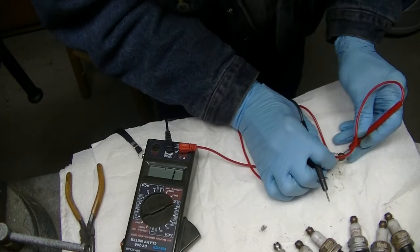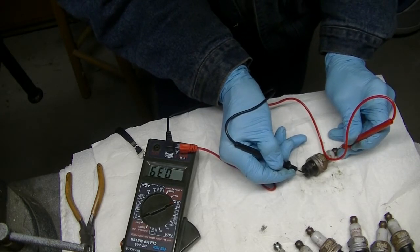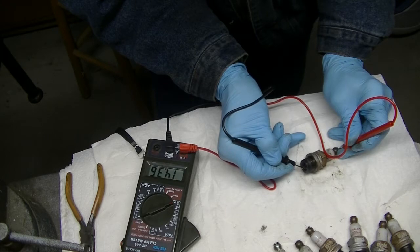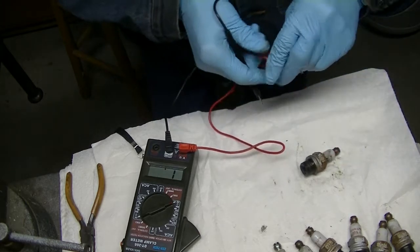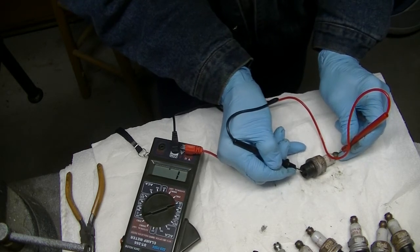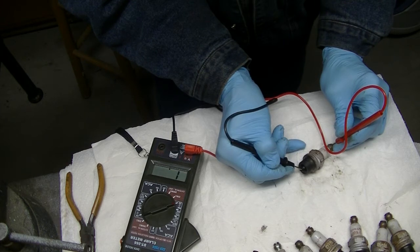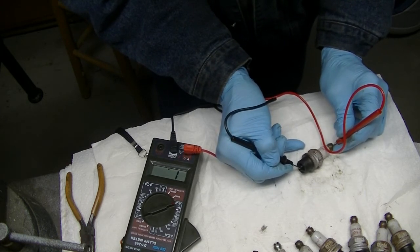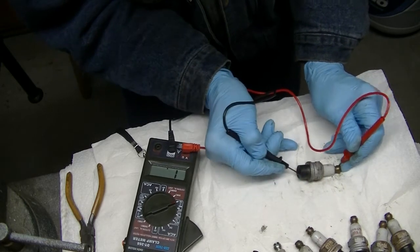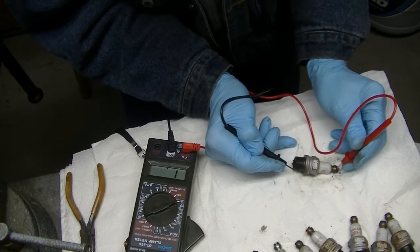Of course, I'm going to clean these plugs. I've got a solution of Avgas 100 low lead that I've put some Berryman's in. I'll clean them and then we'll do this again. I would rather have the Champion plugs in this engine. I've got a brand new set, still in plastic, but I was kind of saving those plugs for another project.